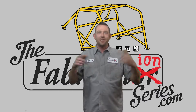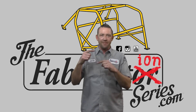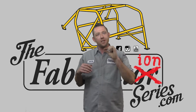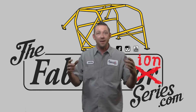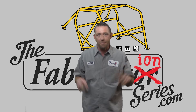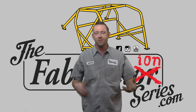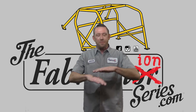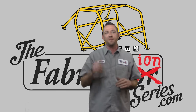Now, I initially forgot to shoot the resetting of all of the tungsten. What that basically means is I dropped every single one of them back down — after they burned back, I reset every single one of them to the proper eighth inch height that we're running for on this test. Since this is such a sensitive topic, you get to watch me talk about this and tell you about it because I don't want somebody going back and picking the video apart saying I cheated on the tungsten test. Everything's been reset, all at the eighth inch height.